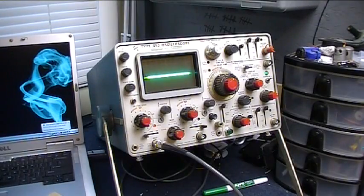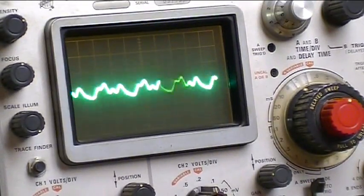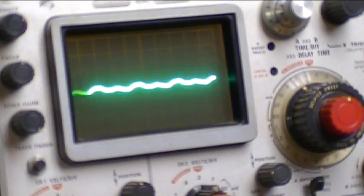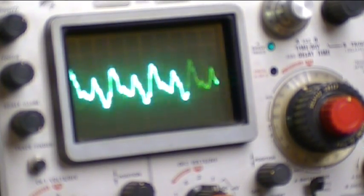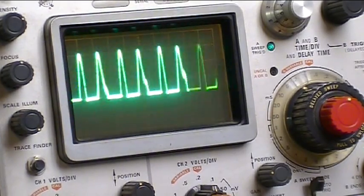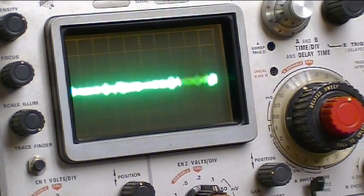Let's start out with just a basic tone with the volume turned down, and you'll see the waveform looks pretty clean — no clipping. Got nice curves on the peaks and valleys there. Now as we turn it up, you'll hear the distortion and you'll also see the change in the waveform on the oscilloscope. You'll see some clipping start to happen. See that flat bottom — got a little noise coming from the open circuitry on the breadboard there.